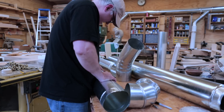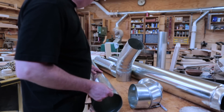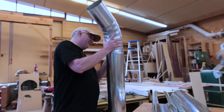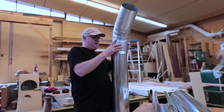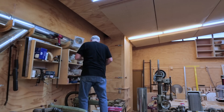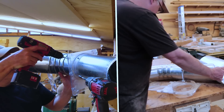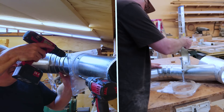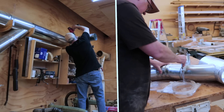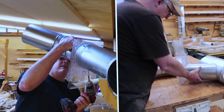They have a little detail that you pop together and it makes a tube. I'm not a sheet metal worker — I'm sort of making this up as I go, but it seemed to work pretty well. The goal is to get a full six-inch line all the way to the CNC machine for enough airflow to pick up most of the fine dust. I've got a metal blast gate, but the flange is on the inside of the pipe and it blocks a lot of airflow, as the opening is quite a bit smaller than the plastic blast gate.